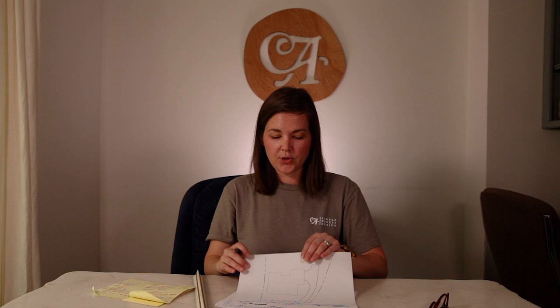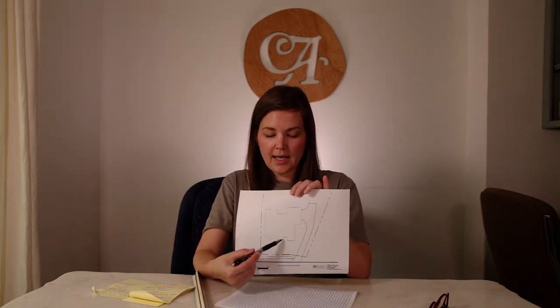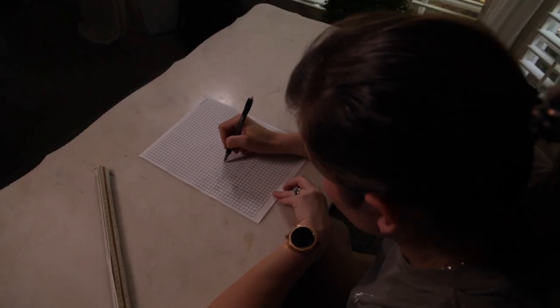So if I'm going to use a scale of one inch equals four feet — that's a quarter-inch scale — then each square equals four feet. I can draw straight down: four, eight, twelve, sixteen feet, then turn and measure twenty feet and then down. Once you get finished, you'll have an outline of your house on the grid paper that will show you exactly where all of your base points are. That's just the base to get started.